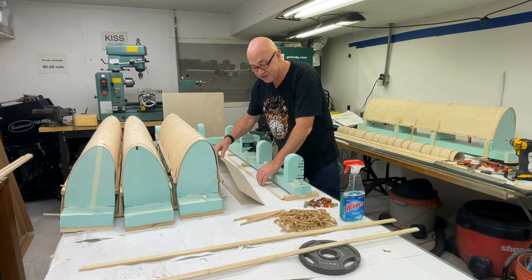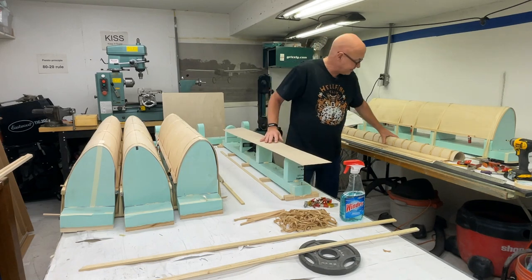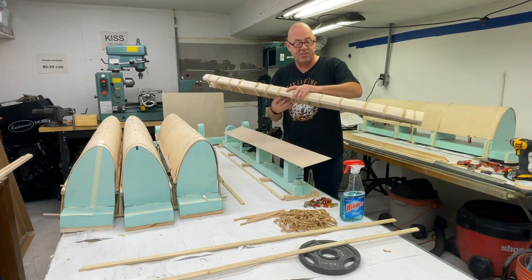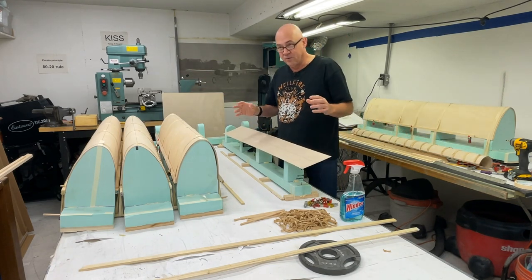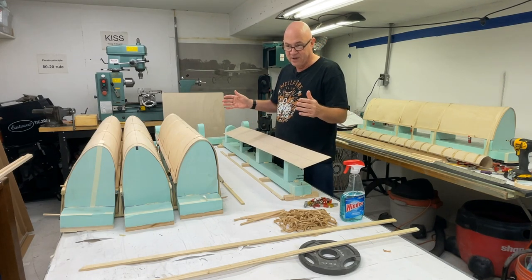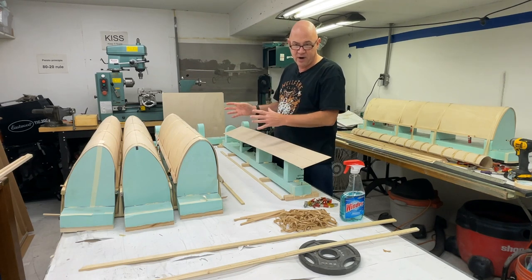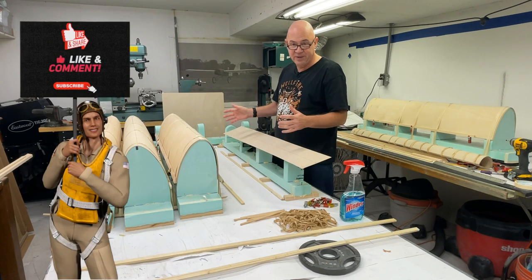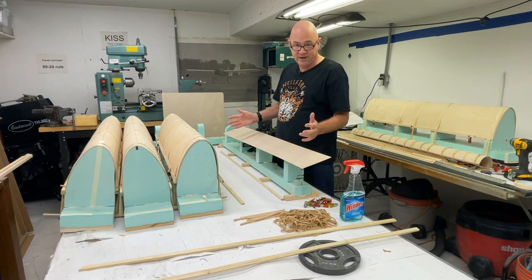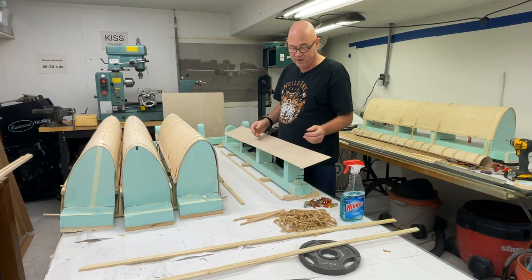So what I'm going to do — this is the last one, believe it or not. All my leading edge skins have been formed to the shape I want. These are all the leading edge skins I'm using rubber bands to keep in shape for the ailerons, except this last one. When you build an Air Bike, it talks about some of the lengths being like 78 or 87 inches. For me to do that would be incredibly expensive because buying from Aircraft Spruce would require a freight truck. If I get it in 48-inch lengths, UPS can deliver it. So I got everything in 48-inch lengths, meaning I need four skins for each leading edge and will trim off the extra two feet or so.